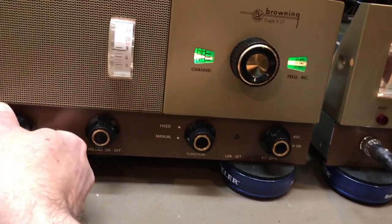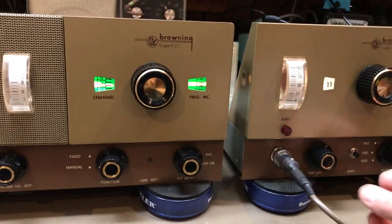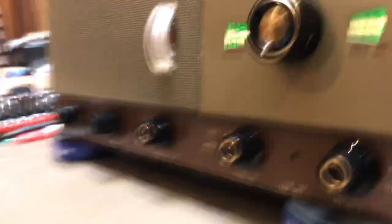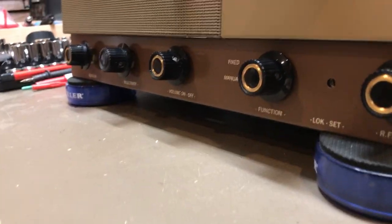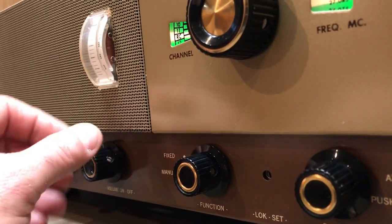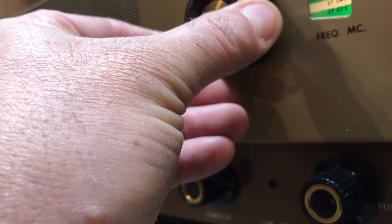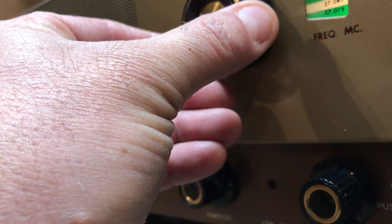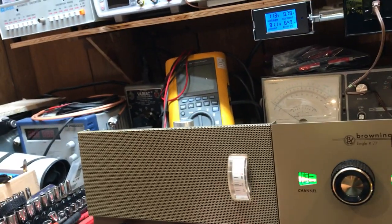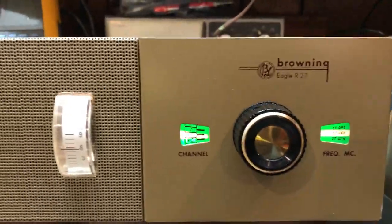I tell people when they do the spot on this, put it over to narrow. You want to find channel 11. Can't do this too good with one hand, but let me just show you. Hit the spot key with it on narrow, volume down. There you go — get right on. Go back to your band, turn the volume back up. Dead on — everything aligns perfectly.